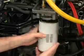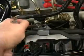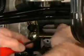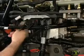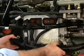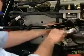Removal of the pressure side fuel filter provides needed access for service. Remove the low-pressure fuel line clasp. Then remove the fuel lines at the lift pump and ECM cooling plate. Remove all ECM electrical connectors and wire harness clips. Remove the ECM, and then remove the cooling plate.